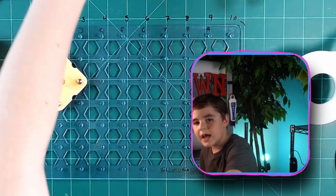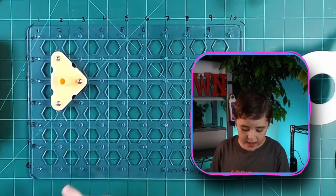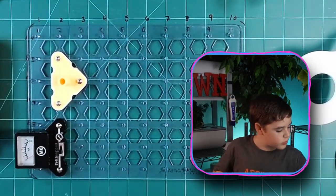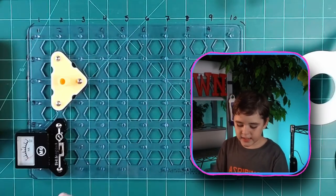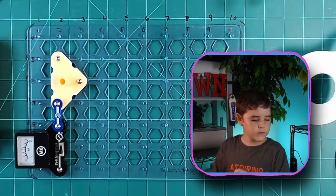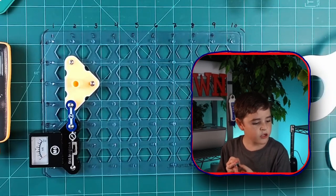Next, let's place our M6 meter right below this point at G2 to E2. Next we have a two-snap wire connecting the meter to the pivot stand. Next we have the S2 press switch — it is a normally open switch that when you press it, it closes the circuit, and when you take your finger off, it's open again. Let's place it at C5 to E5.